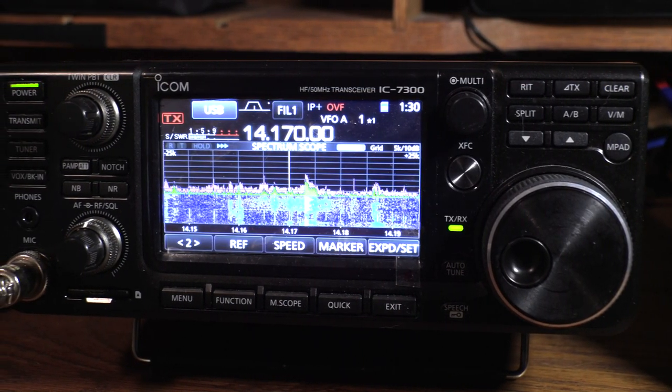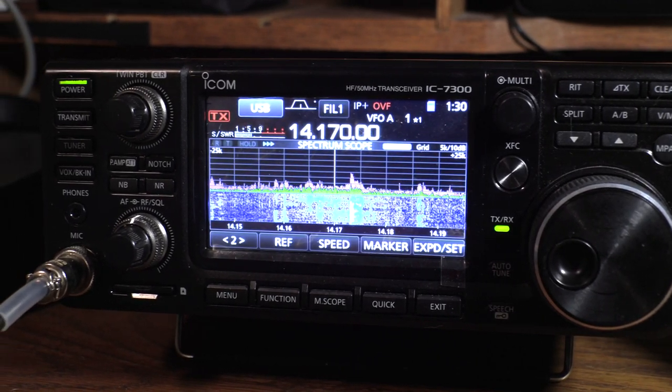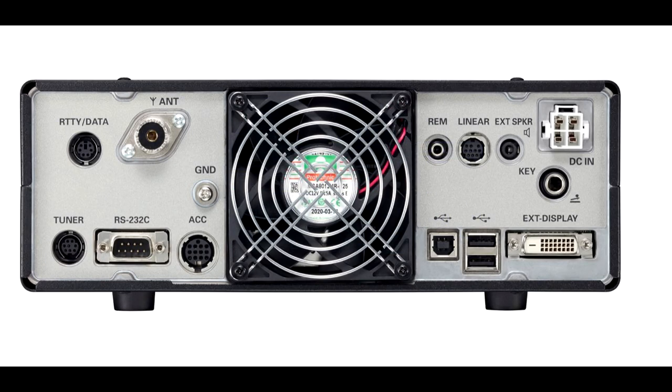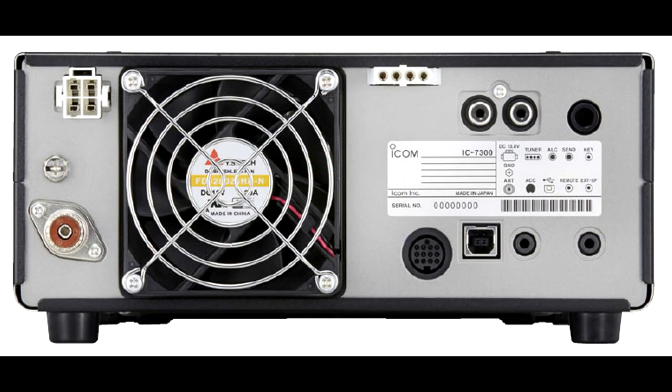The ICOM is nice too and has that sort of military look to it. It has a really nice screen, and if you've used an ICOM before you can operate this rig immediately. Looking at the rear of the FTDX-10, it has a lot of IO — more than the ICOM 7300 — but it doesn't have dedicated RCAs for your amplifier PTT and ALC; you have to get them out of a multi-pin connector. The 7300 looks simpler but does have those two RCAs for your amplifier's PTT and ALC lines.